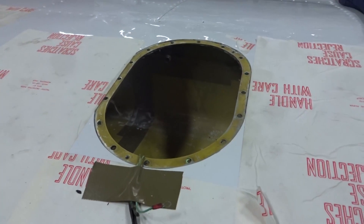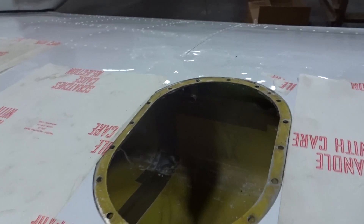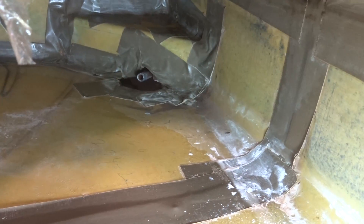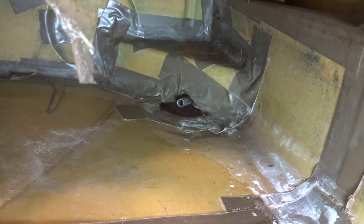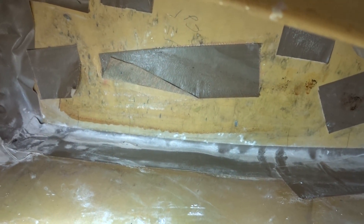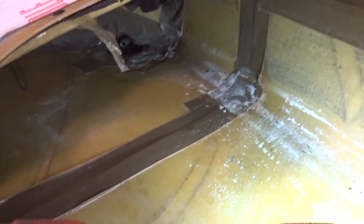The fuel cell is going to go in this cavity — the aux tank will go in this cavity — and we've got the old one pulled out already. In here, we've got to clean this up some more, and we're going to re-tape the areas. The tape actually protects the fuel cell from sharp areas and rivets. Down there is the fuel inlet to the airplane, that line right there, which the fuel cell will hook up to. We'll go through and clean this up, put in new tape, and tape off all the possible sharp areas.